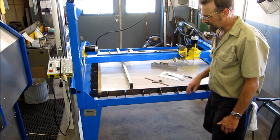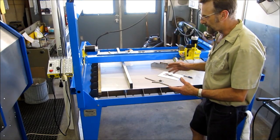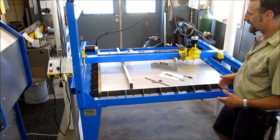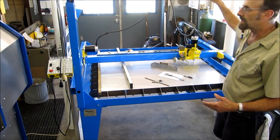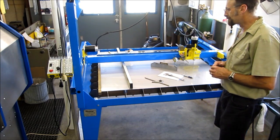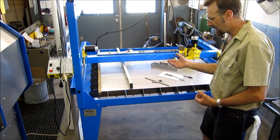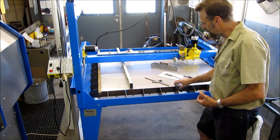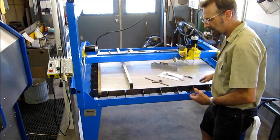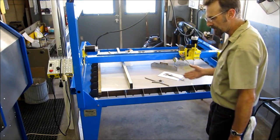While we're waiting and doing the work on changing that gantry out, we're putting down draft suction. You've seen the 4-inch PVC piping coming down on each side of the table — these uprights are just to hold my elbows in position and will be changed out with 4-inch schedule 10 aluminum. We're also working in a water table. This sheet is going to be the bottom of the water tray and we're going to shape the sides and the cowling that goes underneath for the air suction.